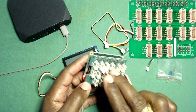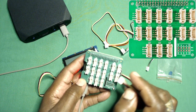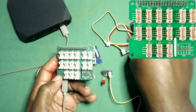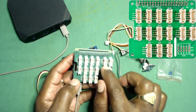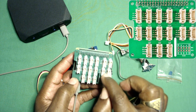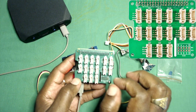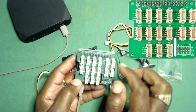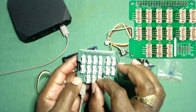In terms of needing a port, I can look for any GPIO port. You can see at the top it tells you this is pulse width modulation - this would be the pin that does PWM for the Raspberry Pi. This is D5, with pin five and six at the top. For an LED, since the second pin is no connection, you just use the first pin. The analog pins are where you'd connect a potentiometer or sensor.